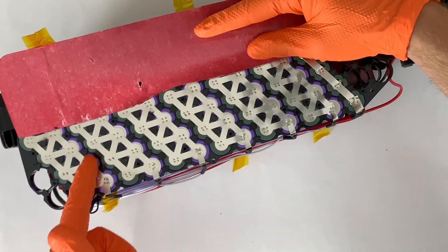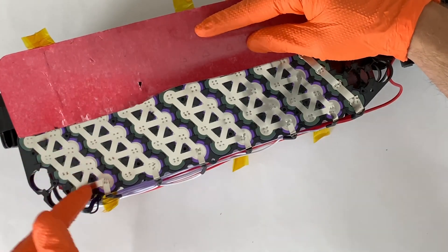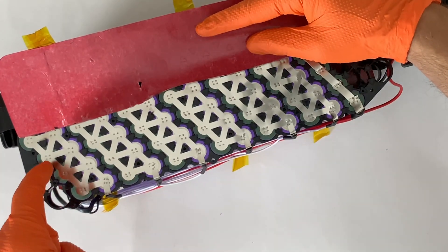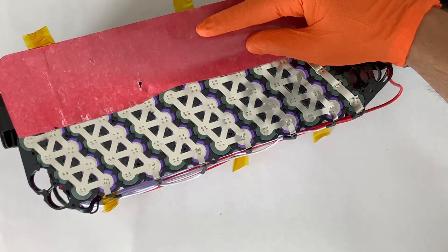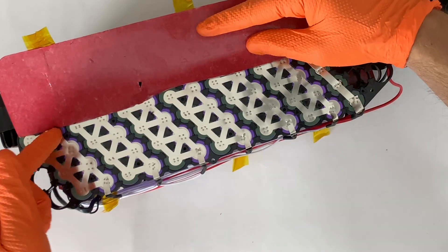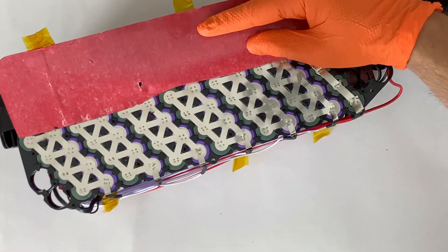The connections between the cells — I would have loved to have seen full width — but we're probably appropriate with the amount of nickel we have here in the series connections. There are multiple series connections per cell: seven connections for four cells, which is great. If you open up a battery and see just one or two connections between series groups, that would be a red flag immediately. You want to see at least one connection per cell, which we do have. The crosses here at a 45 degree angle making this truss system means you get extra series connections — so that's great.